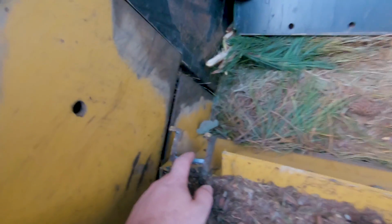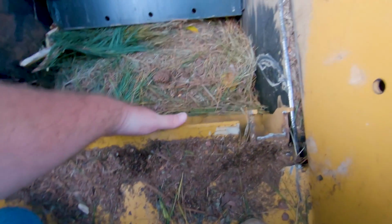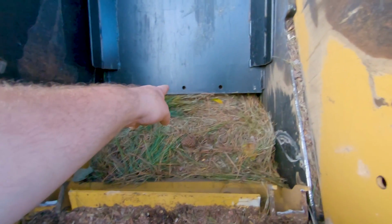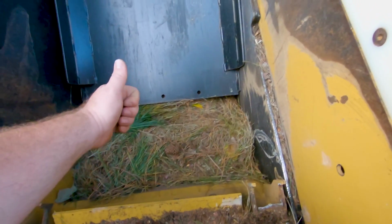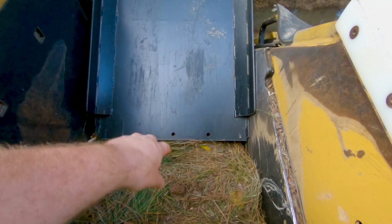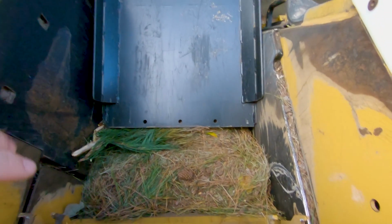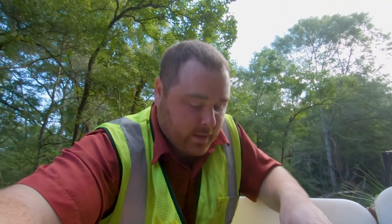So my guess is, yeah, you could probably re-weld that, but as bad as all that's twisted and everything, I don't know if that's going to be worth the time to try and re-weld it whenever you could just buy this plate and it come with these brackets already done up on it. This is going to require a crane. Get a little eye bolt and put in that middle hole right there, and we'll pick this thing up with our crane or a loader or whatever, and set it up here and just repin it, because all the pins and the other blocks and brackets are still all underneath there. So all we'd have to do is get this new plate, I think.